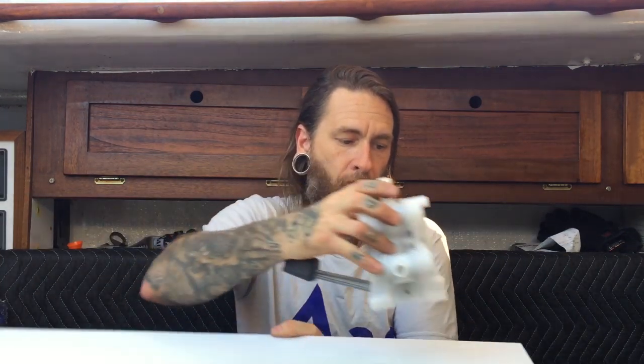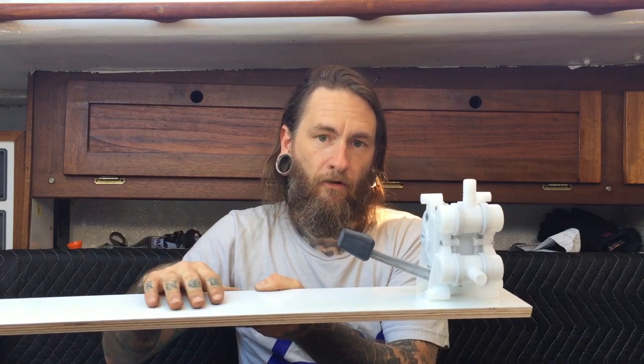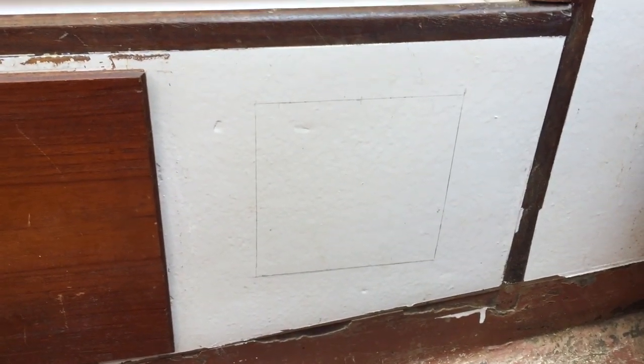Today we're going to get the hole cut and make a little mounting shelf out of this plywood. There'll be another part that goes down and screws into the bulkhead under the stowage area, so it'll mount here, epoxied in the back, and then mount to the forward area. We'll drill our holes for the hoses as well. Here's our stove, and right there - that pencil-drawn area - that's what we're going to cut out.